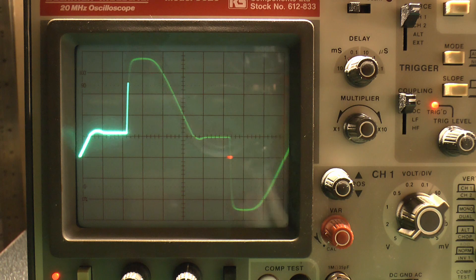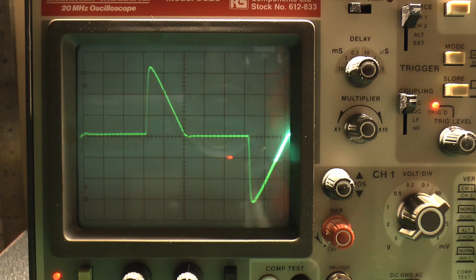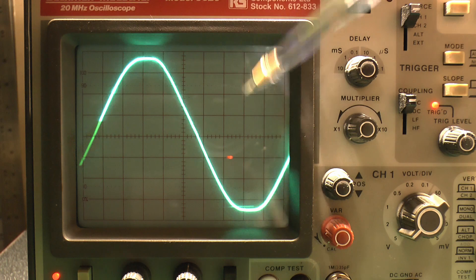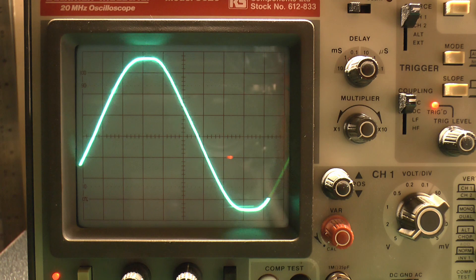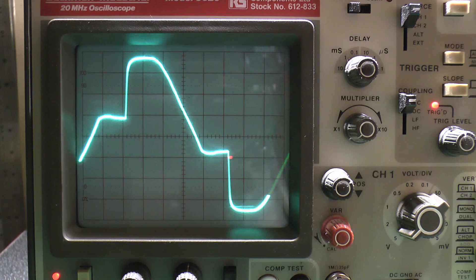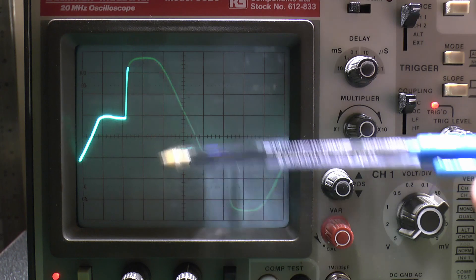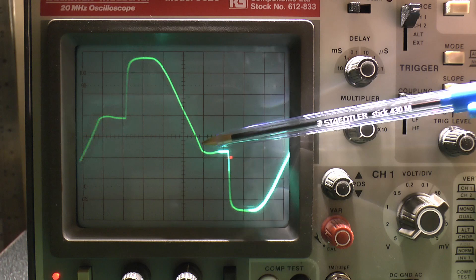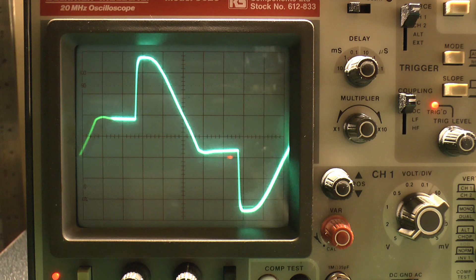So this one can be set in either leading or trailing edge modes. Back on the 60-watt incandescent at full, there are still gaps where it's off. That's the full sine wave, and switching back to this dimmer it will ramp up in the soft-start manner but in leading edge mode rather than trailing. Now switching back to the 10-watt LED — again we can see quite a lot of significant distortion, but even so this is at full brightness. We can see that step initially where it quickly turns on and tapers away, and then the same cut as before.